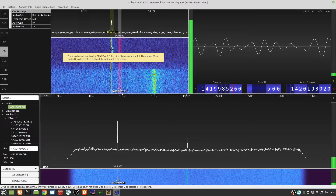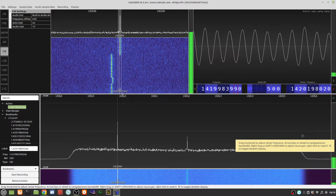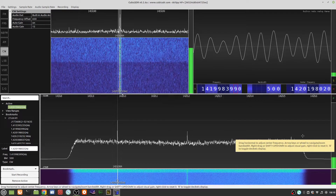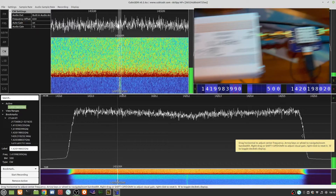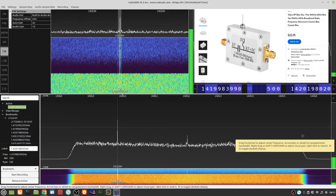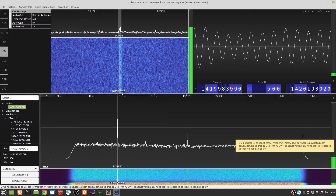I'm still learning the software. Now, that's something right there. Once I add the preamp power for the wideband, it gets a little bit noisy, but the signal's still there. Once I add power to the ultra-high gain low noise part, I lost my signal — but if I turn that off, the signal's much clearer. So once I get the BIAS-T, I should be able to maintain that signal and not have it over-drowned by the powering of the ultra-low noise preamp filter. And this is turning off the wideband preamp — there's not much of a difference, but you can see a slight jump.